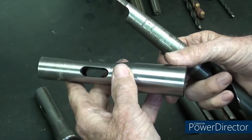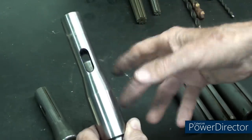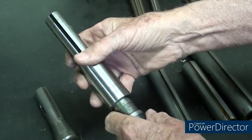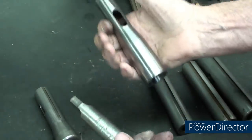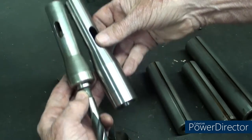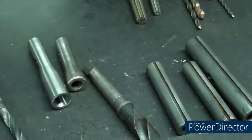This is an R8 Morse adapter number 3, so that you can use a large drill like this on your Bridgeport. You have to take the collet or the holder all the way out to eject it, and in this case yes, it does need to be ejected. If you can't get a drill out and it's really stuck, put a ram rod in here and tap on it and you can usually get it out. However, if the tang is twisted, you may never get it out without doing some damage to some of the other components. This is a number 2 R8, but notice that the number 3 is much longer, which means you have to drop your table quite a bit on the Bridgeport, which is a little annoying, but these can be life savers if you're doing that type of work.